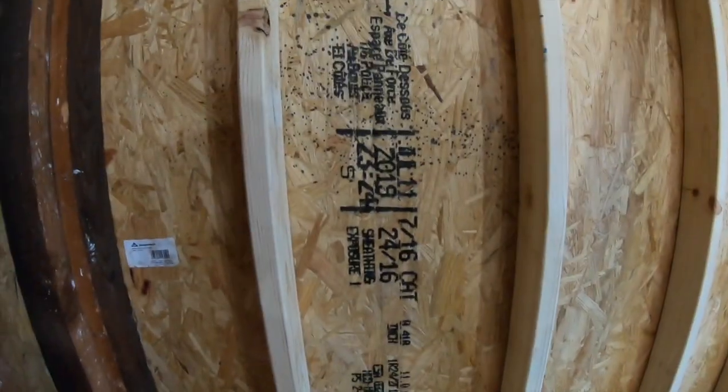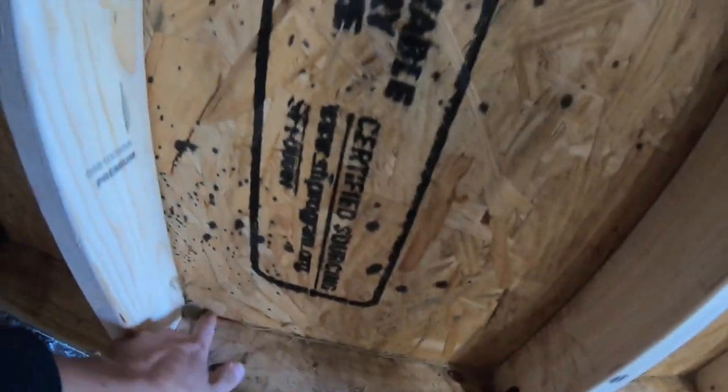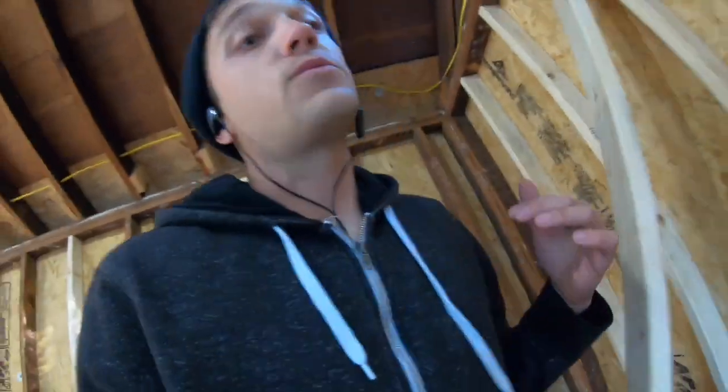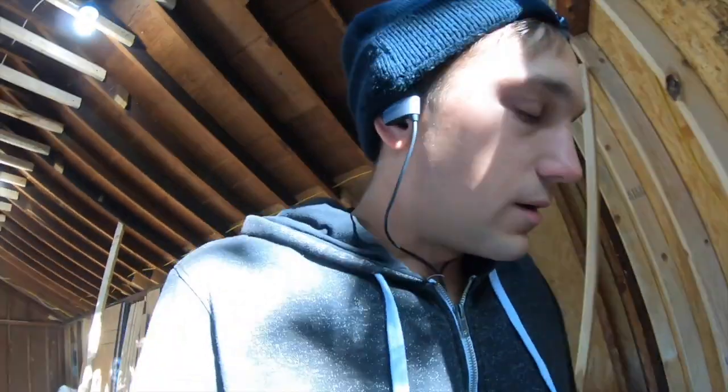It's not going to go nowhere. I have construction adhesive on my seals so that bugs aren't going to crawl up through and drafts aren't going to get through. I think this was a necessary step for what I'm trying to accomplish. Some people might think it's a little overkill, but I think it's completely normal. So, construction adhesive, sealing the cracks where drafts could come through.